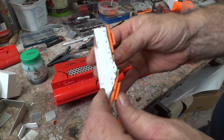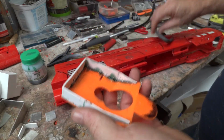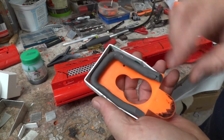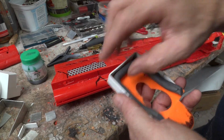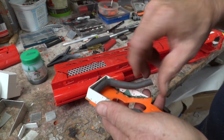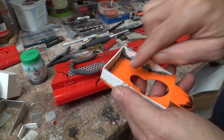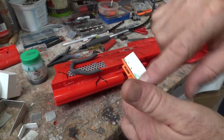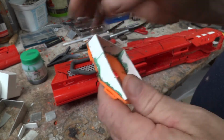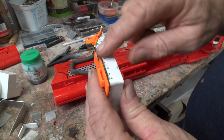Righty-righty, okay, so there's my little piece with the holes drilled, just so the putty can take purchase, and I've done my little trick with the plasticine, work out how much I need, so that's about the volume. It's a bit thick up this side, but there's corners to fill in and so on. So what I'm going to do is I'll weigh the plasticine, work out how much putty I need, and I'm going to put a tape line down on the inside about the same distance from all the edges, and fill it in and push it in, and not worry about the outside, because I can finish that later, because the whole point of these holes is for some of the putty to go through and help lock this bit down. And when that's done I can sand that off and just use a bit of Tamiya putty filler or something just for the little cracks.